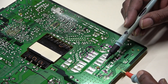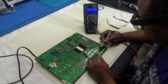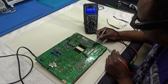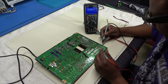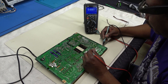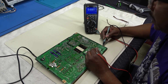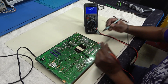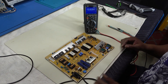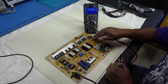But if I go to the capacitor right here, I have absolutely nothing. I should have standby. This is our standby diode right here. I'm going to ground my meter and there is absolutely no voltage on the cathode side of the diode. Absolutely nothing.